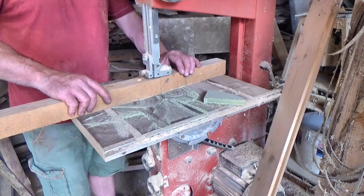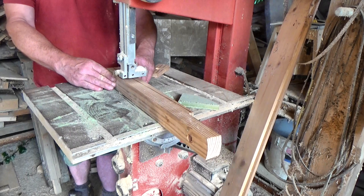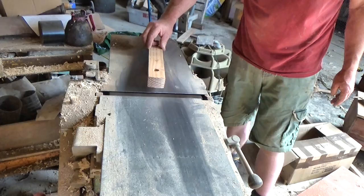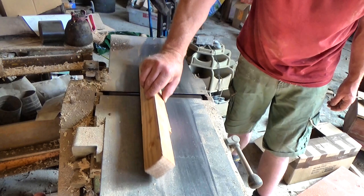Instead of bigger flanges on the tension wheel, I made a tapered wooden guide to go between the arms. The belt should only touch the wooden part when it's slack and not actually spinning, so there shouldn't be any wear on either the belt or the wood. Only when the belt is tight will it engage with the metal wheel, which should spin freely on its own shaft. Well, that's the plan anyway — time to put everything together for a test.